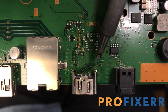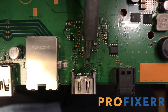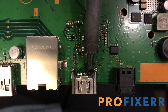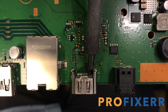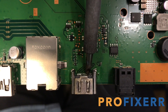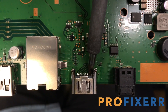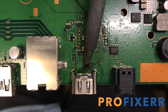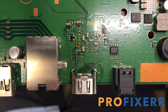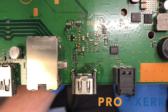After we've done the left side and the right side, we want to hit the pins on the back side. There's actually some low melt left on my soldering tip, so just applying that there and making sure we get all the way to the edges. Remember that you need to actually touch every single pin. Just because you're within the vicinity and the tip of the iron seems very hot, it may not be enough — and probably won't if you don't actually touch the actual pin. Make sure you're touching every single pin, and that will accelerate the transfer of your low melt as well as the heat, making it a lot easier to pull the port off.